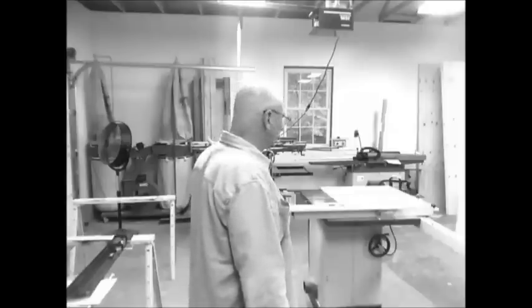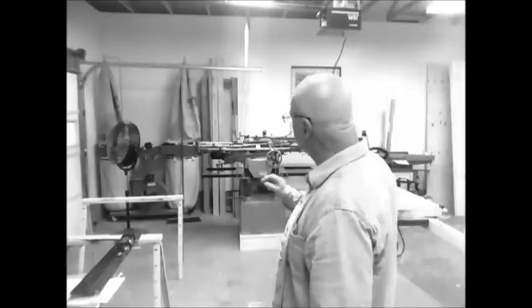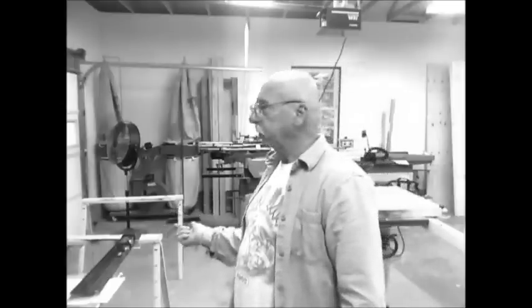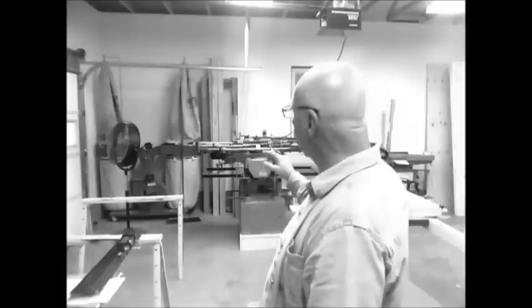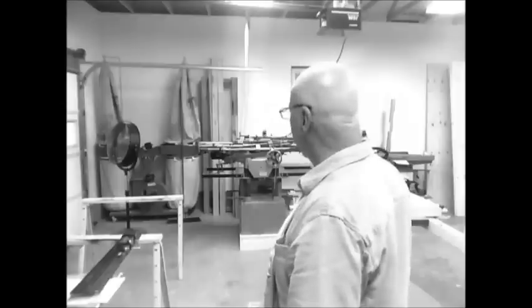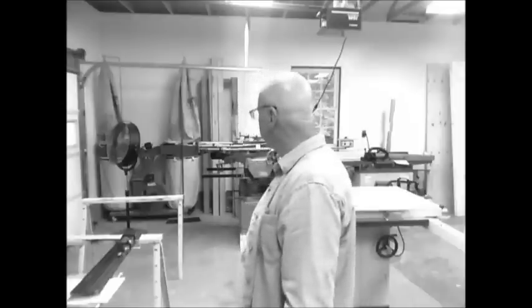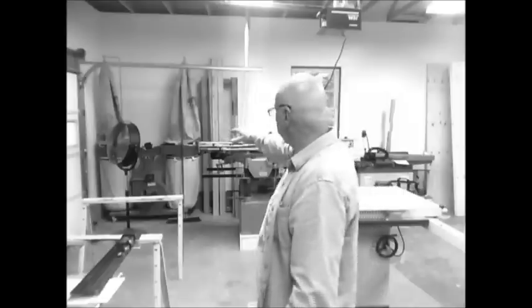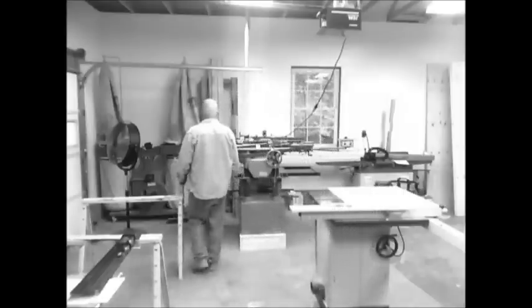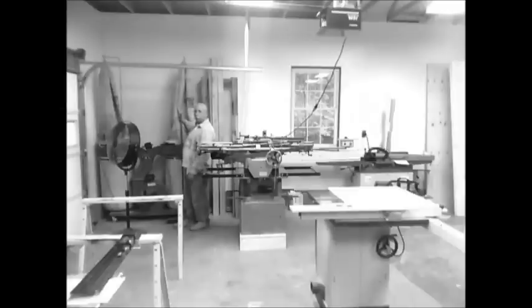What else have we got? Dust collector. Yeah, that Jet dust collector, it does the job, but the bags on the bottom are supposed to collect the dust, not the bags on the top. And the bag on the left, when the bottom one fills up, it starts filling up into the top one. And for whatever reason, it's not really shifting over to the one on the right. I would have assumed that it's supposed to fill this one, and then once there's restriction of airflow due to the dust building up to here, it should go over to the other side, but it's not. It's just coming up and filling about another foot up into this bag.